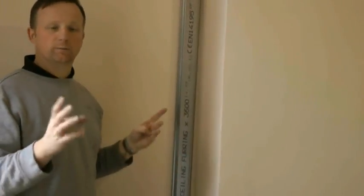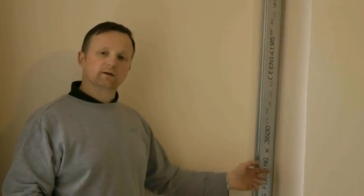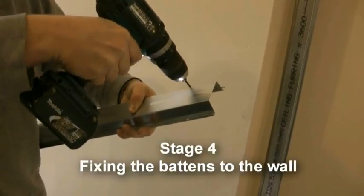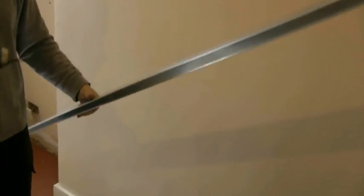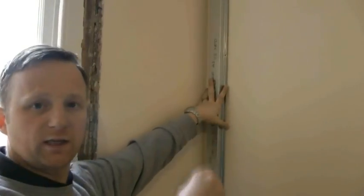The reason it's metal is because the polystyrene will sweat — you've got heat from this side and cold from that side. It used to be that we'd put timber battens on, but they go rotten, and screws or nails through them can rust and come through the other side of the wall. So now we use metal, because it takes a lot to create that kind of condensation. Every two or three feet, same again. I'm marking out where the holes drilled through the metal are, so when we drill into the wall we know exactly where they'll marry up.